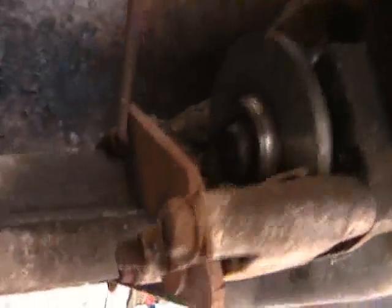All this vari-drive stuff is coming out from under the tractor and I'm going to start ripping all this vari-drive off. The vari-drive is right here — got the belts, gotta take all that off, unhook the brake and everything. These tires are kind of rusted on so I'm not taking those off. I've got my stilts up and I'm starting to take off some idler pulleys. Looks like a 5/8 would work — yep, 5/8 works.